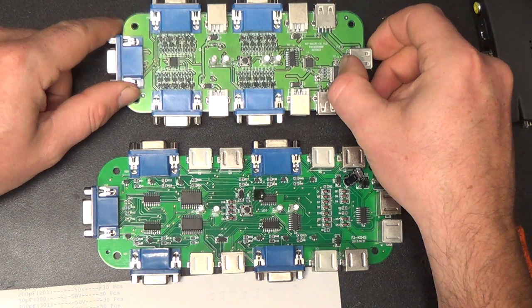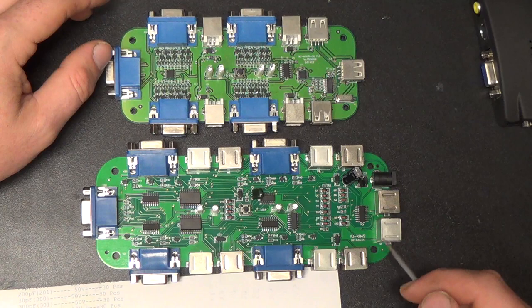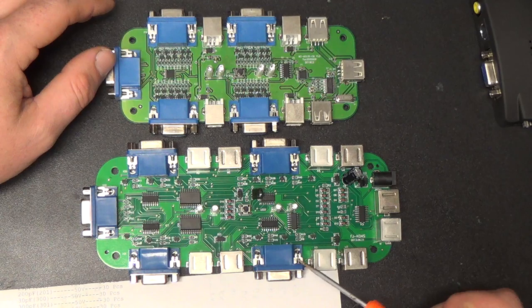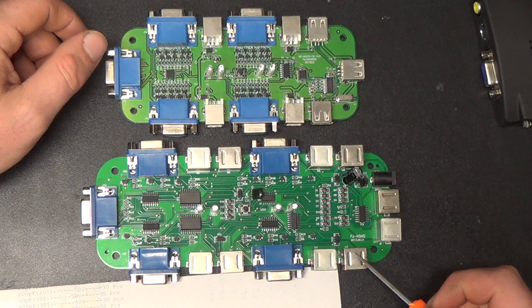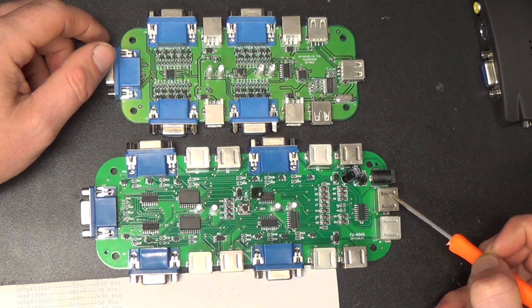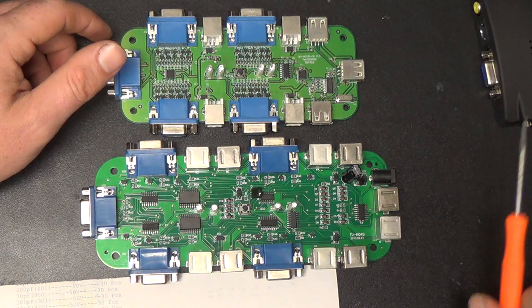So these diodes must keep the PS2 ports from interfering with each other. So we've got how many here? We've got a dozen here. There are 10 ports right there. So I don't know, man. They don't divide evenly into each other. Although, no, they still wouldn't divide into each other, right? I don't know, man. I'll try to put some anti-spike diodes across the signal lines on our prototype circuit, assuming we ever get around to building it, and hope that that is good enough to keep the ports from blowing something up.